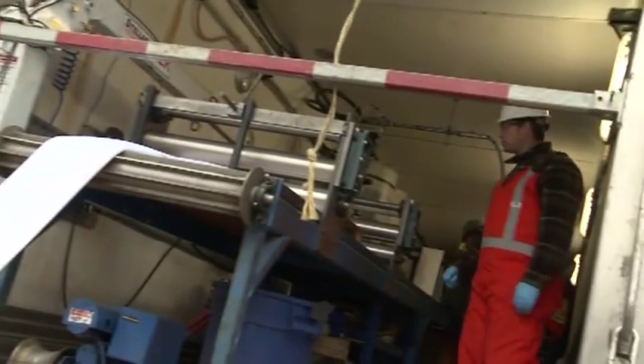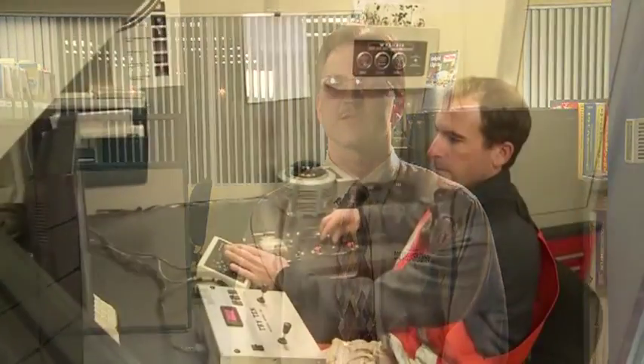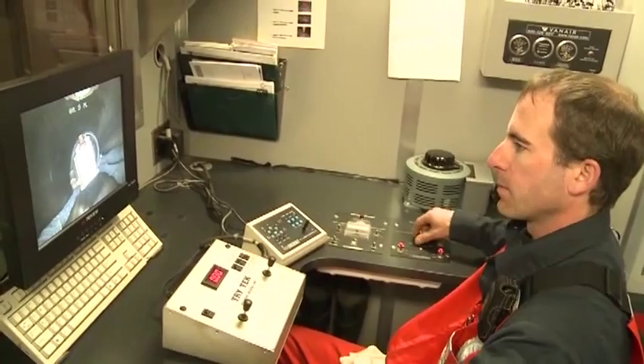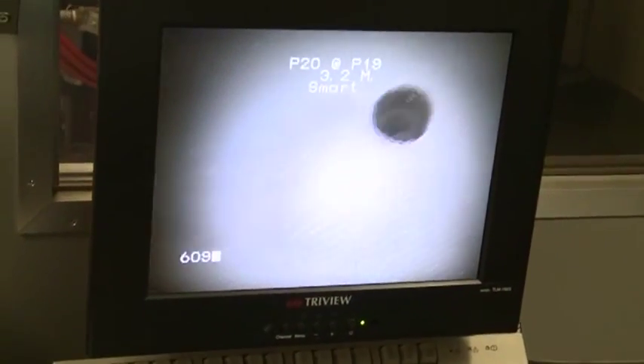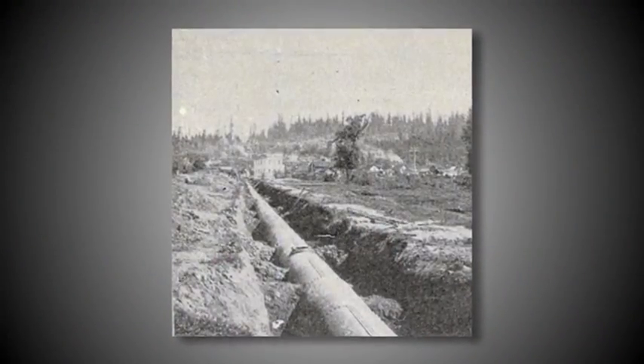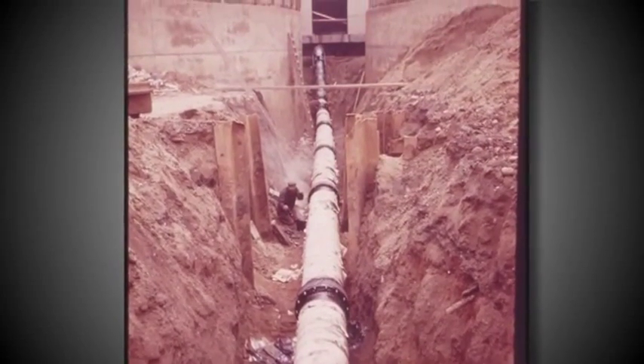The trenchless technology prevents water main breaks and eliminates the need for further maintenance interventions. In Omaha, we've used structural lining to renew our old water mains numerous times over the last several years. What really drew us to it is the fact that it uses remote-controlled robotics from an operator outside the main to inspect the main and reinstate the services after the project's done. This saves a lot of excavations and costs, makes the project safer, and provides all the benefits that go along with minimizing cuts in the streets and site restoration.